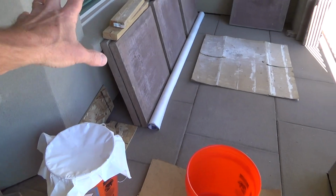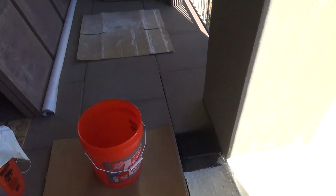And I've already put some roofing mastic, flooring goop, whatever you want to call it. And I've already put that down here. I've done it at least 4 different coats, maybe 5, and I went around the edges with the webbing tape and all that kind of stuff. This is all like a layer of rubber now. And it should be fine when I get ready to install these concrete pavers back down, but I want to be extra fine. So I thought I would put some Tyvek paper wrap, home wrap down.